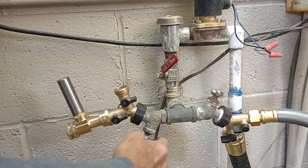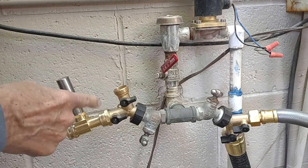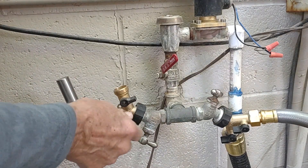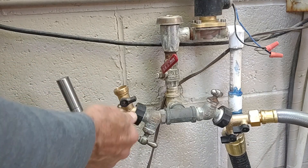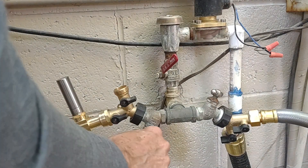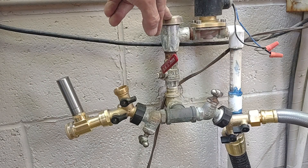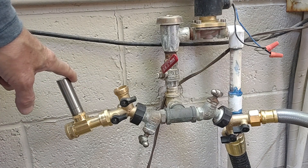I'm going to turn on this tap, applying water pressure to this whole circuit and pressurizing the air in this little cylinder. I also have this so I can do multiple experiments at the same time to see how it all affects things. Now we are pressurized. I'm going to go back in and do the same test against my baseline — cycle the pool filler mechanism five times and see what kind of results we get with one water hammer arrester in line.